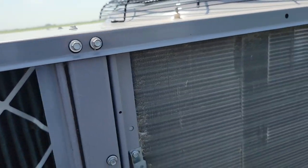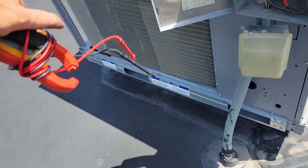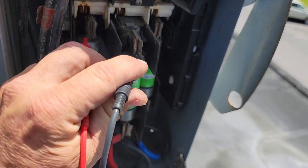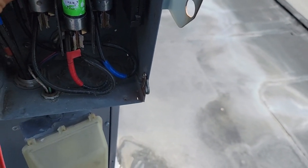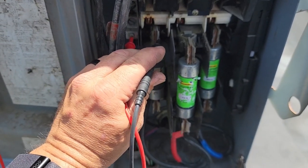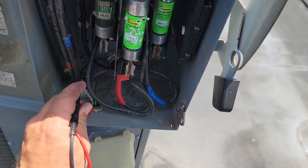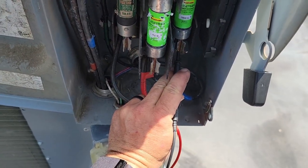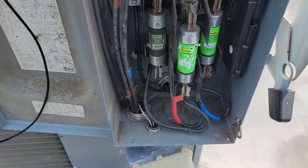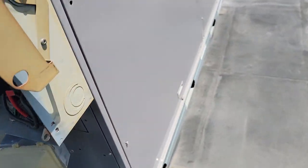This has no codes or anything like that to make it brain dead. So let's see what we got inside here — we come across the top here and we are dead, nothing at all. Let's go to ground right here. Now let's isolate and see if we're shorted to ground — something bad might have happened. No buzzy buzzy, nothing. So did somebody shut it off by accident because things aren't labeled well? Let's go downstairs and find the breaker for this and see what's going on.